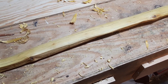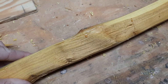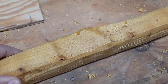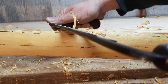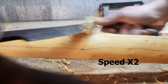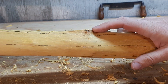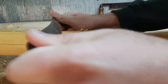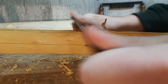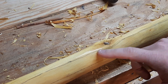I'm going to talk to you about taking these knots out. When you have a stave that came from a smaller diameter tree, knots tend to run towards the center of the stave — that's because that's where the center of the tree used to be. Before you do any cutting on this side of the stave, I recommend you get that knot out first. As you cut on these knots it's not going to be easy; you're going to hit really tough spots because the grain will be twisting and you'll be hitting broadside against that grain in places.